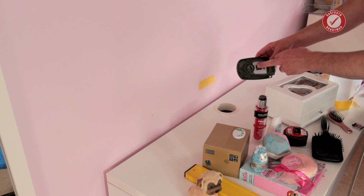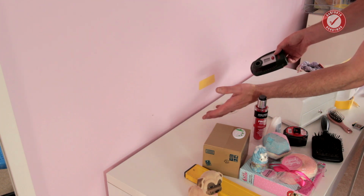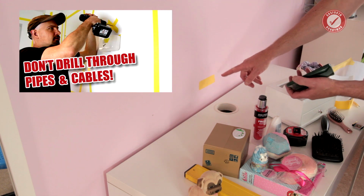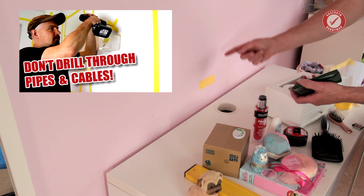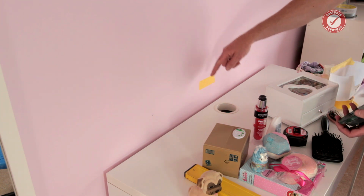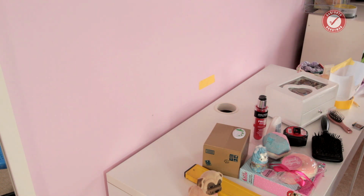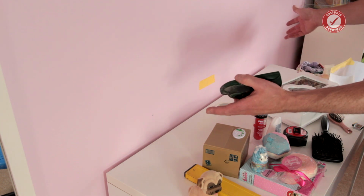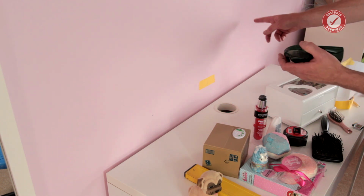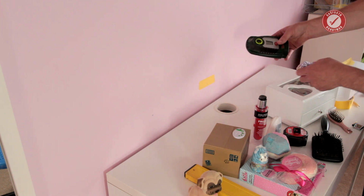Then get your detector. We're just going to check there's no nasties in the wall. I've already made a video all about not drilling through pipes and cables in walls. I'll include a link in the description to that. The thing that I'm looking for here is, are there any sockets underneath here, which there aren't? Are there any radiators around? What's on the other side of this wall? So these are all the things that go through my mind before I drill into this.